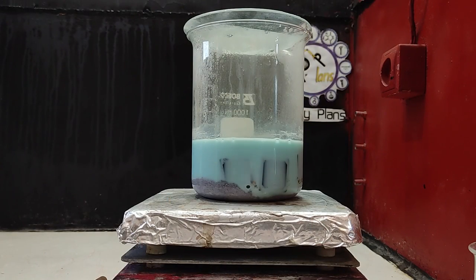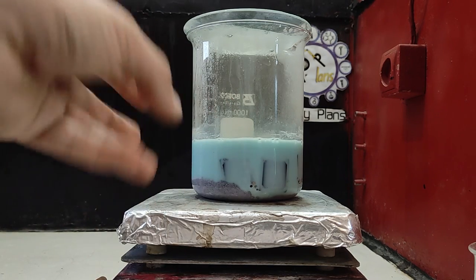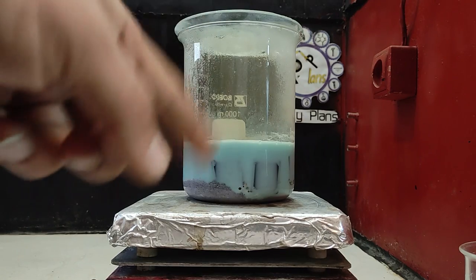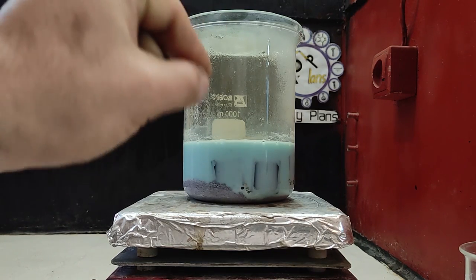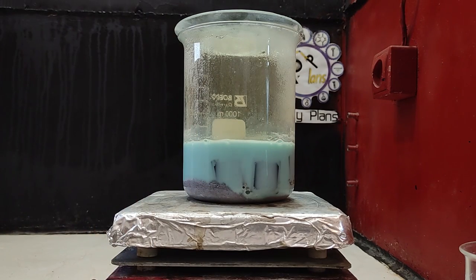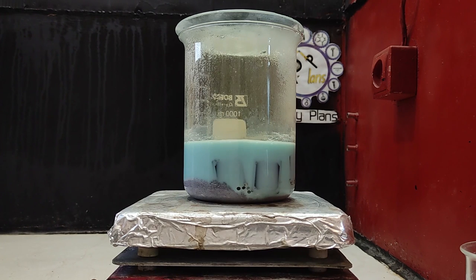The reaction was going for about 1 hour, and there is a hint of blue in this solution, which means the acid reached the base copper. I'm going to remove the BGA chips before the gold foil is released in this huge amount of metastannic acid. But you should be careful about this because there is toxic lead metal dissolved in this procedure, and you should be careful not to touch the solution.